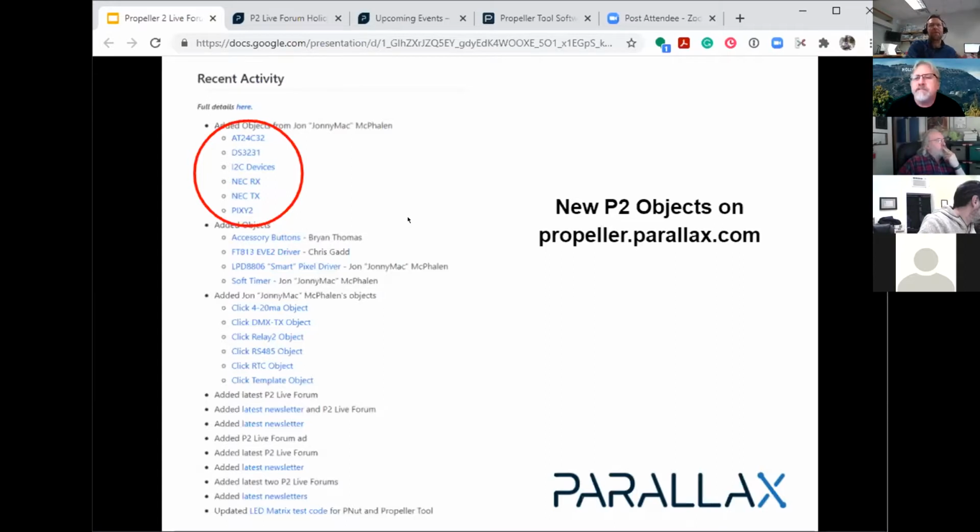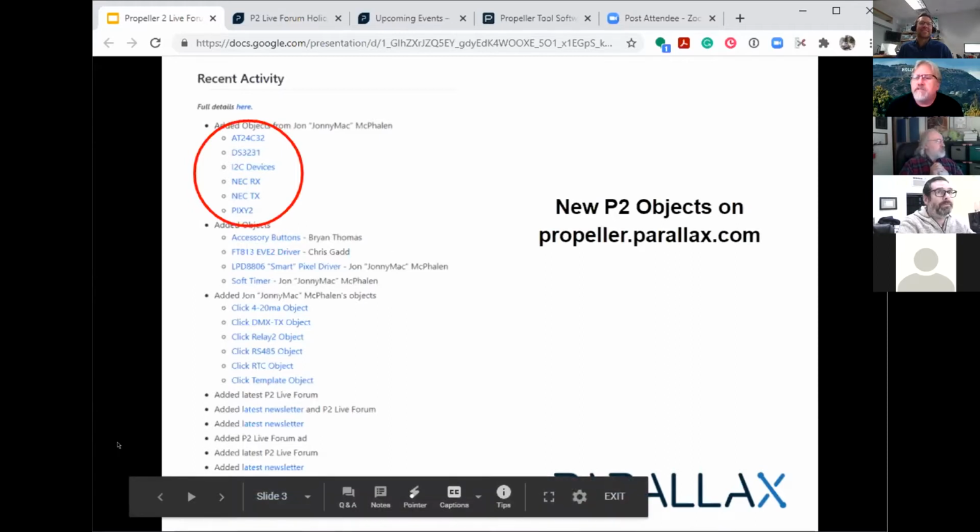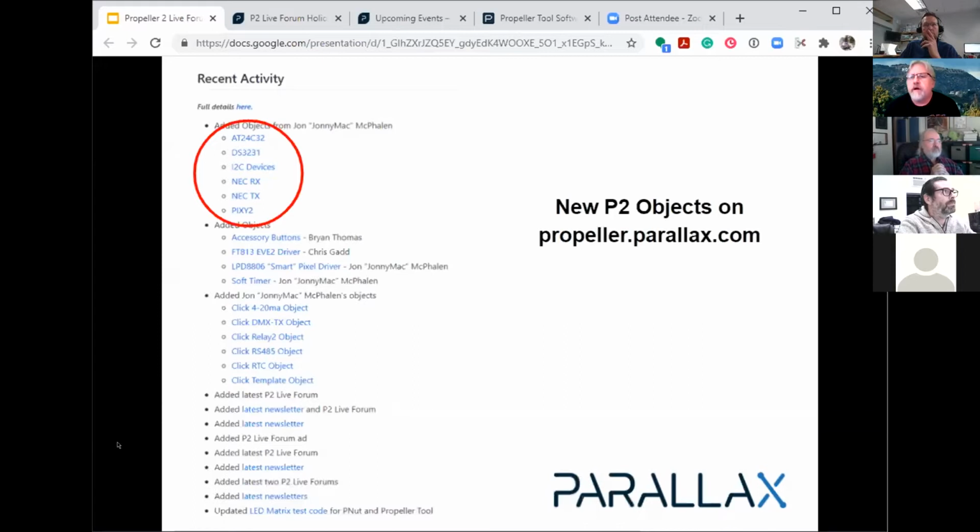It's an EEPROM. So this is just a very simple read and write layer on top of I2C for that EEPROM. The reason for that is for Ken and my friend Casey and anybody else who gets a kit, you can see my Johnny Mac is heavily populated with the RTC, and this module that's an RTC has that EEPROM on it. So we're using that so that we can add time to the project. And also, until we have a file system object for the flash chip, it's really tricky to save parameters right now, because flash is not easy to use, where EEPROM is dirt easy.